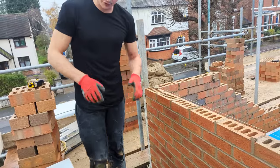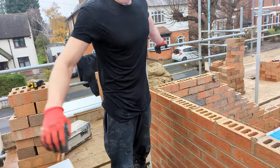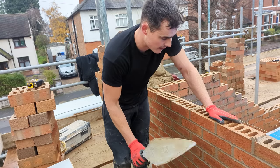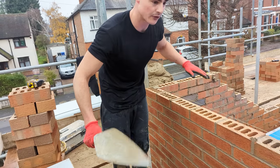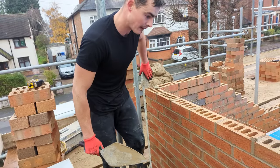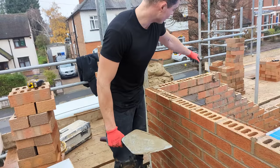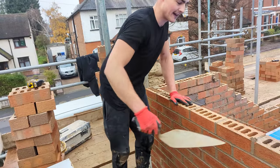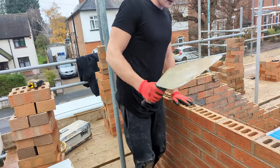So what I've done — I've put an entire wheelbarrow of compo there, about five buckets, and I've got four buckets over there. When I'm working on my own, I like to work in a small confined area with loads of compo and loads of bricks. I've got a window reveal there, so I'm just going to build to my profile, rack out a massive corner here, and rack to my window reveal. This is what I'm going to be on with for this morning — let's see how many bricks we can get down. It's about half nine, so we'll see how we get on.